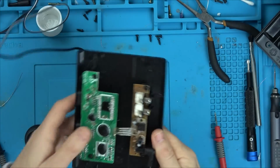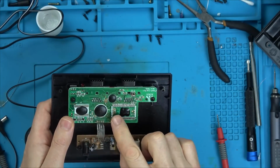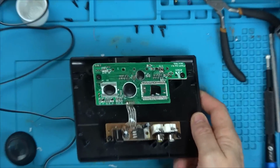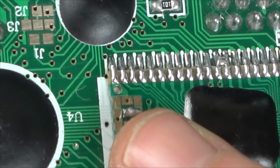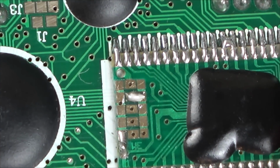Right, fantastic. So when I was messing around here with the low melt solder, a tiny little bit must have just gone across that and bridged to that one there. So hopefully now it's going to work. I hope it's going to work. Can you see there? There was just bridged slightly onto that bit. And through the beauty of editing, I can actually show you exactly when that happened.